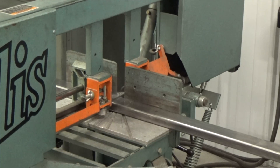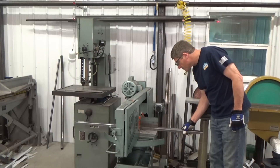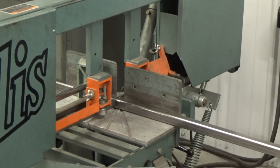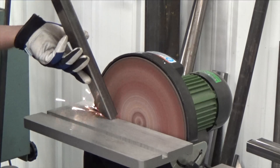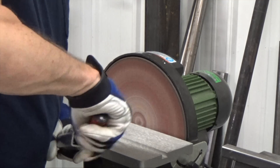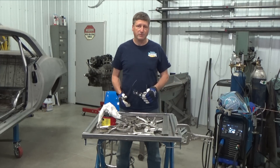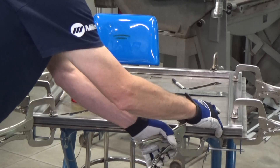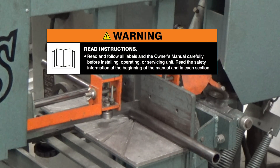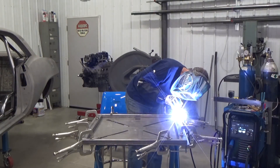My dimensions will be 28 inches square. Start by cutting the one by two into two pieces 26 inches long, and two of the one by one pieces to 28 inches long. Deburr the cuts and grind the weld area of each tube and wipe with acetone — this will give you better weld results. I'm doing a combination of TIG and MIG for this project; you could definitely use either process. Now just square the parts on the table and clamp in place. I like to tack the outside corners first, then the inside.